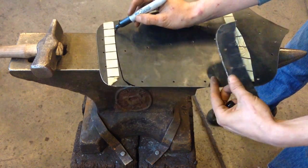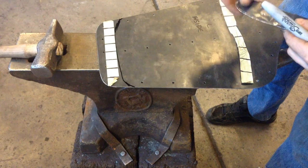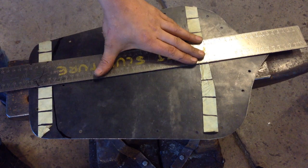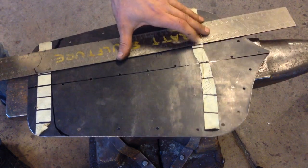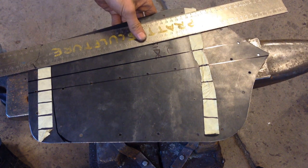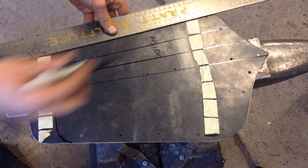It's much faster to do in flat sheet metal than when it's curved. We're going to finish laying out our range so we know where our bends are. What we did was measure the tape and subdivide it for each of the bends. The center line is the middle fold of the tape, and because each tape piece was measured to the length of the material and then subdivided the same number, we get the right taper for each cross section to do a uniform bend. The shin is much more uniform than the forearm when it comes to taper and contouring.